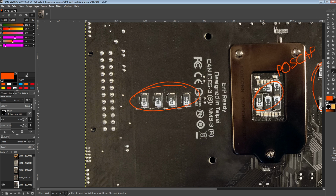I don't think those will actually do anything. I've done some checks for memory. I've done some measurements of memory, sort of transient response, and the thing is, memory just isn't very difficult to power. The biggest transient you have is the refresh cycle of the memory sticks, and unfortunately, if you measure that transient on one of the really small capacitors that's directly attached to an actual pin for one of the memory chips, the transient looks really bad.